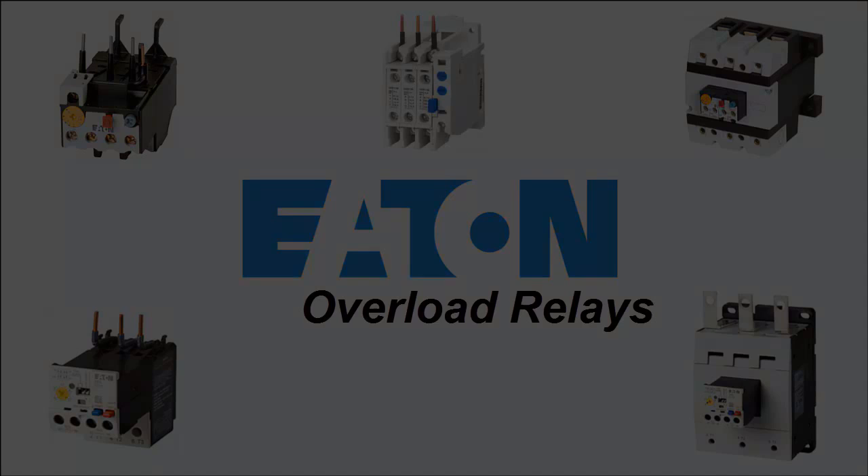First I'm going to talk about bimetallic. An overload relay is typically mounted underneath the contactor, often having three prongs that go directly into the load side terminals of the contactor. We say it is coupled into the contactor. The combination of these two parts is called a motor starter.